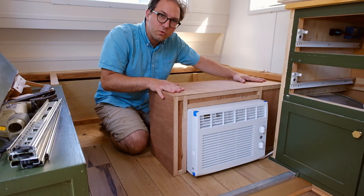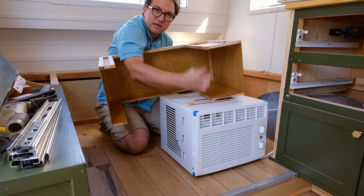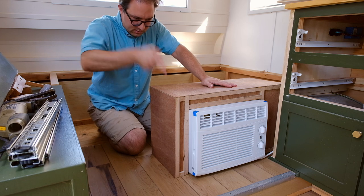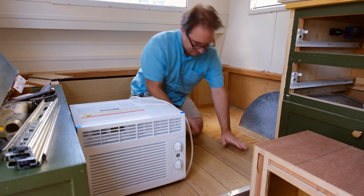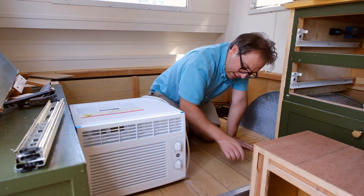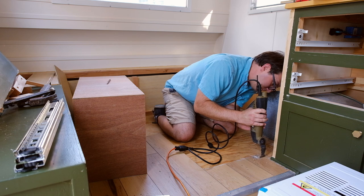This is about where the air conditioner and the shroud is going to go. I had to locate where the framing was underneath here because the intakes are this size and this size. Now that I kind of know where that's going to go, I can drill some holes down and then come back with the jigsaw and cut them out. I realized this is actually a floating floor, so you don't want to drill or nail into it. I'm going to cut it back from this point about three inches, pretty flush with the front.